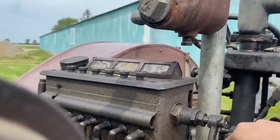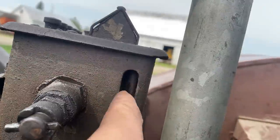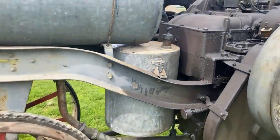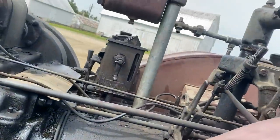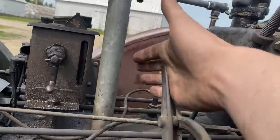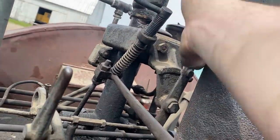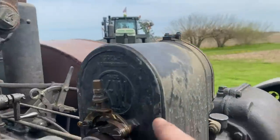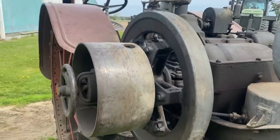You'd want to look through there and check that you actually have oil dripping down all those holes. Look in your sight glass here — there's an oil level right there. Now this tractor's ready to start. Once it starts, it'll be pretty loud. As soon as it fires, you reach up here, push your choke down, then push the compression relief closed. Your engine's going to speed up so you're going to screw your throttle in, and pull your ignition timing a little bit forward. Once it starts, walk over to this side and make sure that this little lever is up and caught in that position, because if it isn't, you're going to wear that impulse out really quickly.